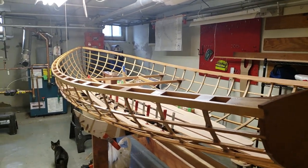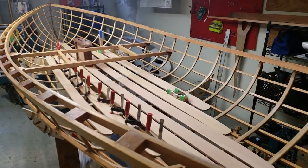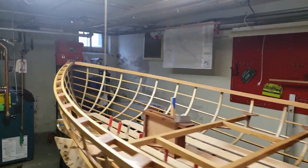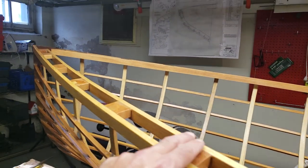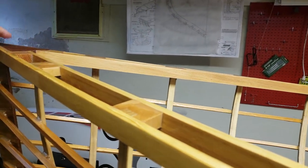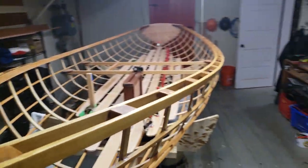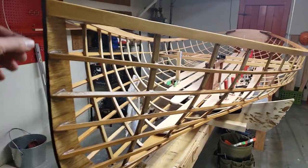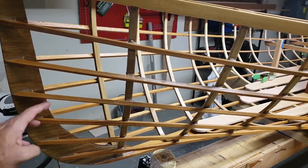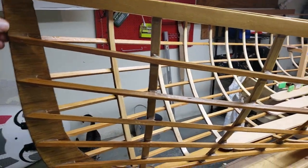One thing you'll notice is I've added a few more floorboards than the plans call for, because I had the stock and wanted a broader base to put my feet on. Another interesting bit: I did not taper this inner gunnel into the breast hook like the plans call for — I just left these parallel and then made this mahogany block to tie everything together. The plans call for a two-piece bow stem with fir coming in at about here with a scarf joint that I think was vertical.